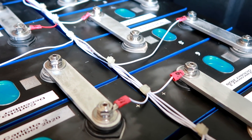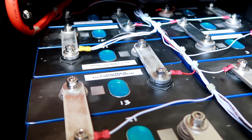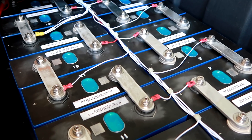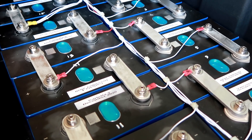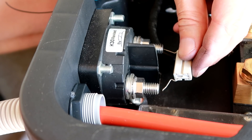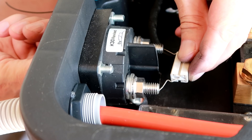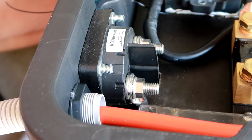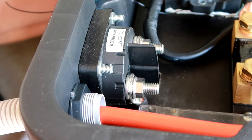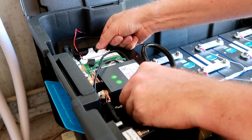Replaced all the bus bars with the aluminum laser cut bus bars now. Tightened all the screws again and cleaned up the terminals and contacts of course. So hopefully I don't have any terminal bus bar high voltage problems anymore. I can pull 100 amps here without any problems. Let's wait until I can hear the inverter clicking - it just did. Now we can turn on the switch. No spark, no high current inrush. Let's plug in the BMS again. Everything is up and running - we just need some solar power.